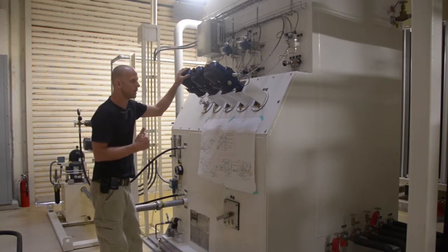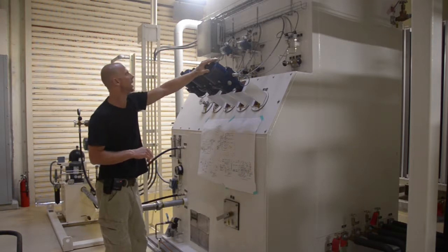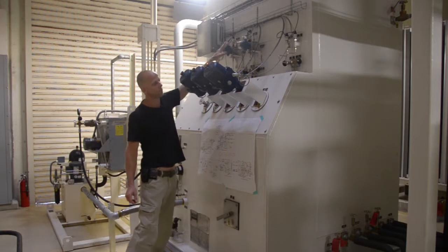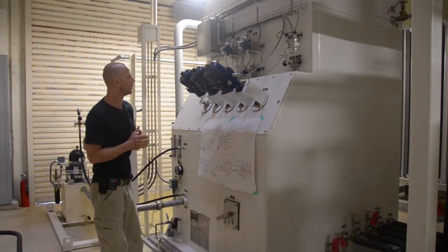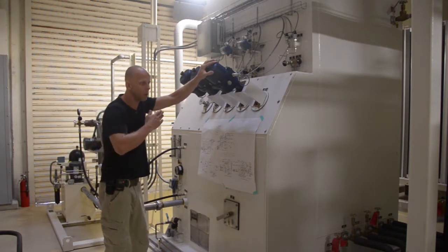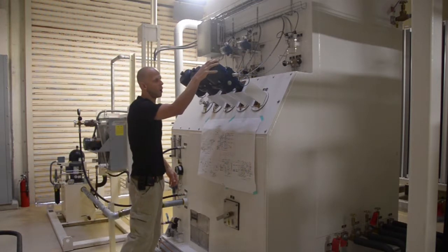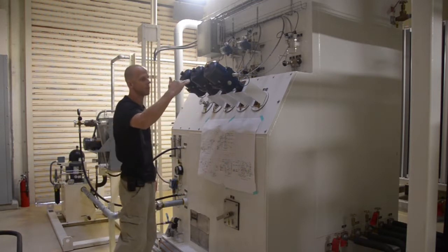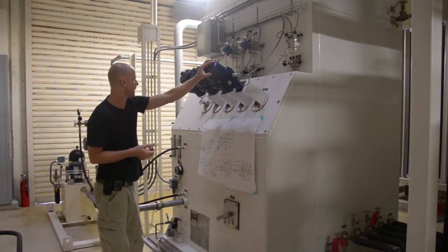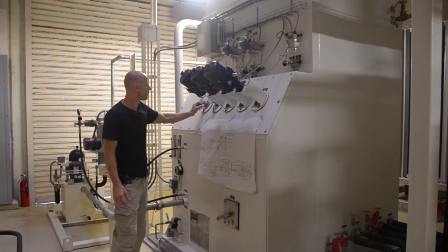Likewise, the level of oxygen in the top column will be controlled by LCV 530, and we have LT 530, which monitors our oxygen liquid level. As the liquid level rises, LCV 530 will remove more liquid, thereby maintaining it, and this is our oxygen product valve. At the same time it's controlling the liquid level, it's also controlling how much oxygen goes to our tanks. Okay.